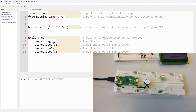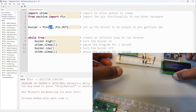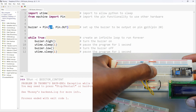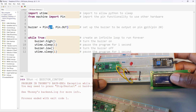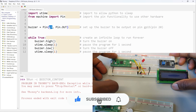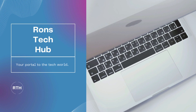That's how we connect a buzzer to the Raspberry Pi Pico. Please keep in mind that the pin you use doesn't have to be pin 15 — it could be whatever pin you want; I just chose 15 because it was easy to work with. Later on, I'm going to attach that same buzzer to a circuit with my LEDs: the green LED will turn on when it's warm enough, the red LED when it's too cold, and the buzzer will also go on when it's cold. I'll also have the temperature on screen at some point. Any programmable GP pin you want to use is perfectly fine. Thanks for watching — hopefully that was useful.